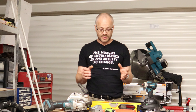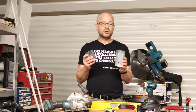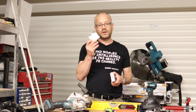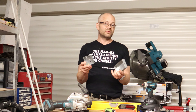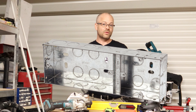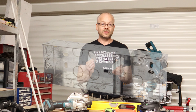To do this job we're going to need various different tools and accessories. I'm going to be using both a one gang and a two gang box. I'm putting a socket in the two gang and extending my telephone cable into the one gang box. You can buy these ready-made in a dual box, but they're generally 35 millimeters deep and I don't need to go that far, especially since the wall I'm chasing into is single skin.